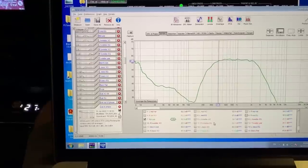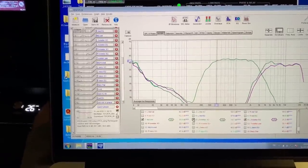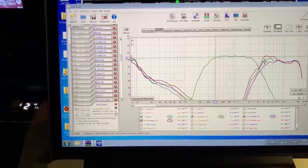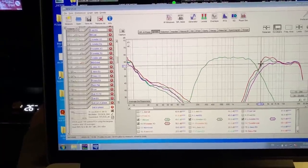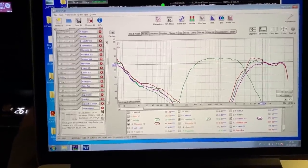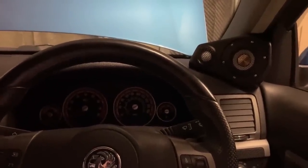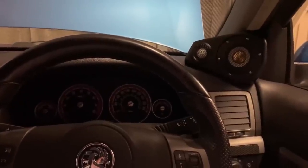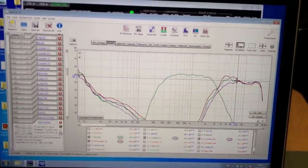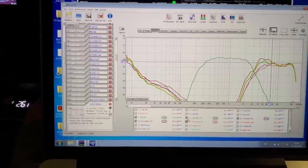Then we jump onto tweeters. The left tweeter, already EQed, had peaks here and there with the crossover which I got rid of. The right tweeter had a bigger peak — people would think there's a peak between 3.5kHz and 7kHz making it harsh, wanting to cut your head off. But it's not the tweeter, it's the environment. And then people say 'this is a metallic tweeter, it must be really harsh, I want to swap it out' — no. Once you flatten the response it sounds just as smooth as a soft dome.